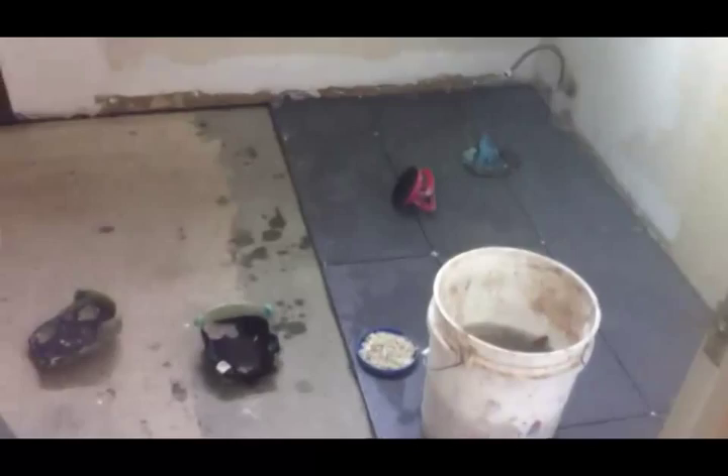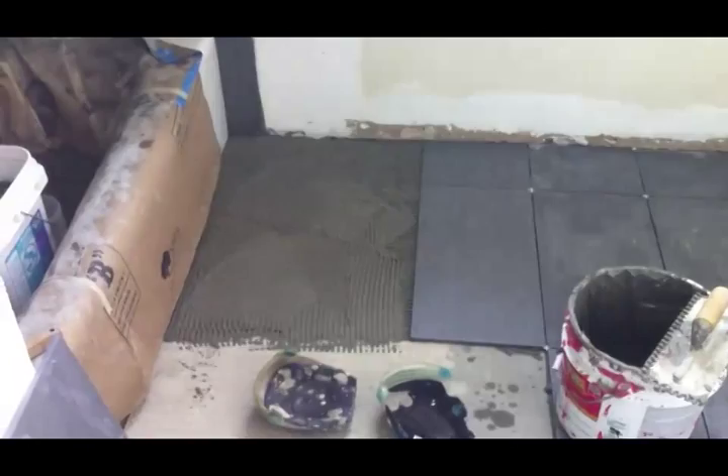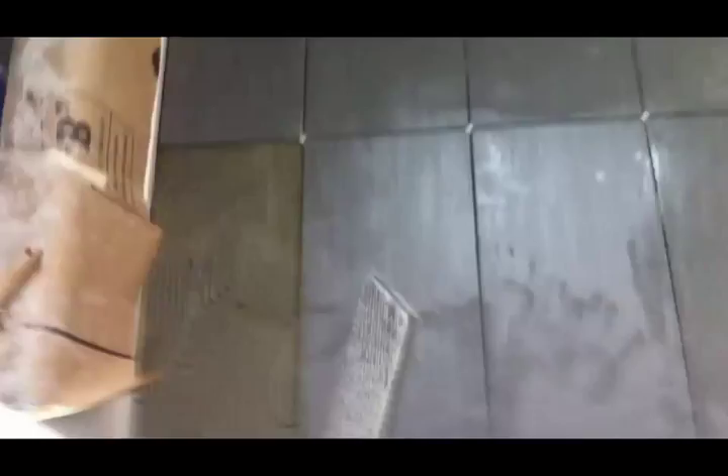I got my first row in. Just like the wall, keep it nice and even — don't let your thinset be too loose. Check around the drain and the toilet flange — there's always a hump there, so make sure before you begin it's all flat. Cruising along here — the floor is just flopping in, so easy. As I'm setting this floor I'm running my hands over it to make sure it's flat. No toe catchers — it's a beautiful floor.